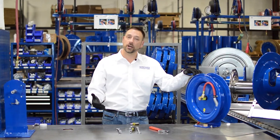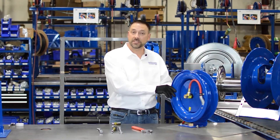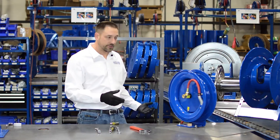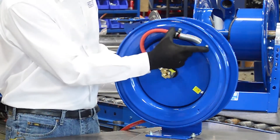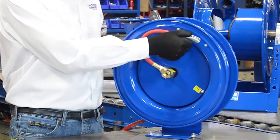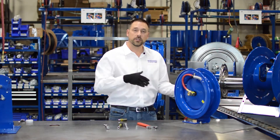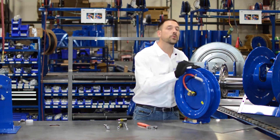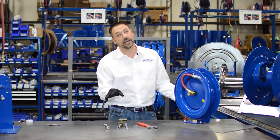Now we're going to talk about loading the hose using the post-tension method. I've gone ahead and prepped the same reel — removed all of the hose but left all the other work: hose installed with two hose clamps, hose protector, 90-degree service loop, and it's installed into the swivel. The only difference is that I didn't pre-tension the reel — it's currently in a neutral, unlatched position.